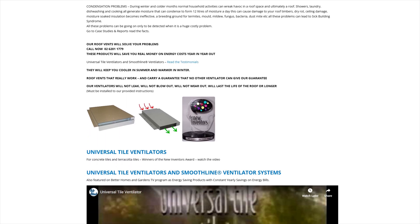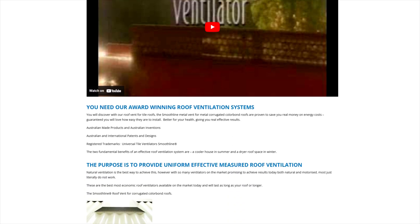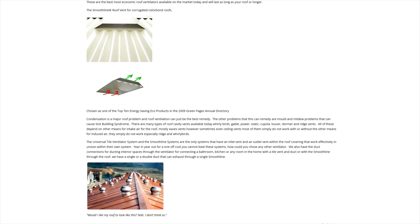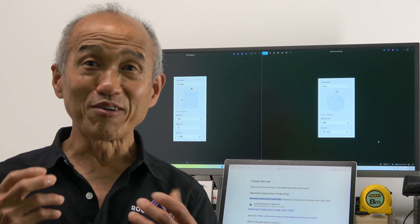The great thing about whirlybirds — although there is a hole in your roof, people think the fan spins and centrifugally sucks, but it doesn't. If you had a roof with whirlybirds on it and wanted to simply add more incoming air, we can go above the insulation line with our vents around the perimeter, and that'll make those whirlybirds work like a beast. So it's going to be like a hybrid — instead of eaves vents, we put in your ventilators, and then the whirlybirds work and stay there. You put them all around the perimeter and get really good cross-ventilation channels everywhere.